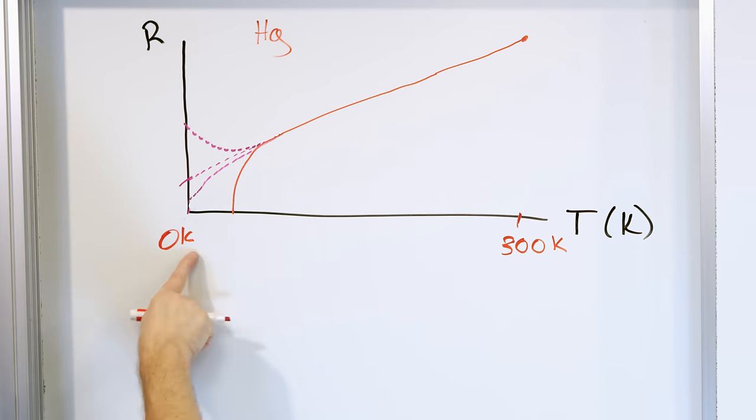As soon as you bring this thing close, like when I was dropping the magnets, the magnetic field starts to try to penetrate this conductor. But as soon as the first magnetic field line attempts to make contact with this conductor, immediately at that moment, this magnetic field induces an electric current to flow in the conductor. We call it an eddy current.